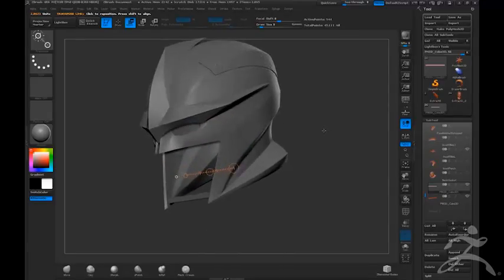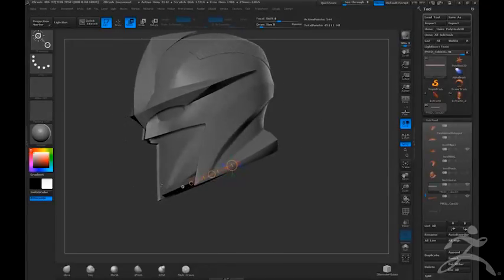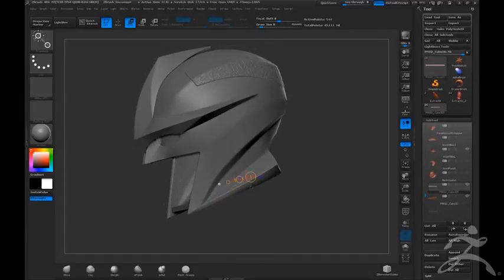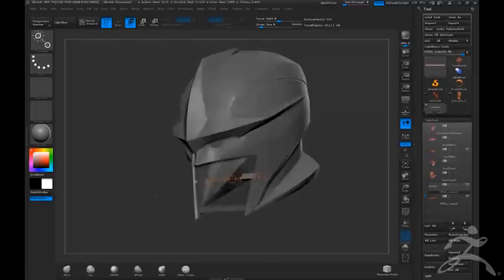So in order to prep this piece such that it can easily be cast right off the printer, you will actually want to have a return here, I said, of between 1/4 to 1/2 inch before you have these cubes placed in there. Because what that's going to do is, on set, whenever you have these helmets, typically on a return on the inside of a helmet, you'll only see between 1/4 to 1/2 inch in. And so this keeps them from having to worry about any marring on the surfaces that you're actually going to see on screen.